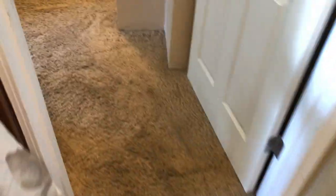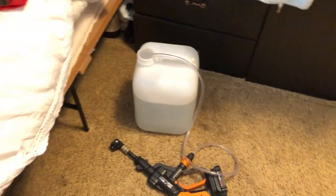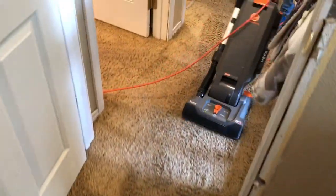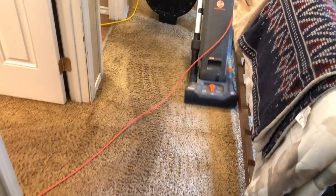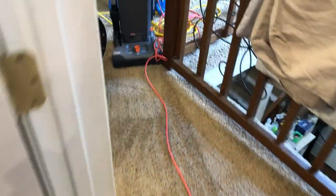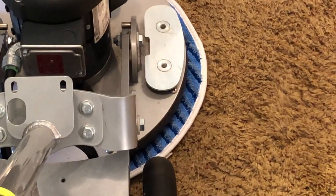I have my wonderful wife helping me out today. She's pre-vacuumed all the rooms. I'll be pre-spraying with Green Dragon used at two ounces per gallon. I did add two ounces of the CLO2 — the odor death — as there was a slight odor in this home. I usually put a couple ounces of CLO2 in every application but just don't mention it. The deodorization is included. The Green Dragon dries down to a brittle crystal — no residue — and it does leave a form of anti-resoiling agent behind, so you can pretty much call that the protection.